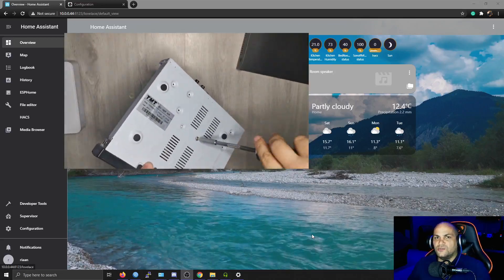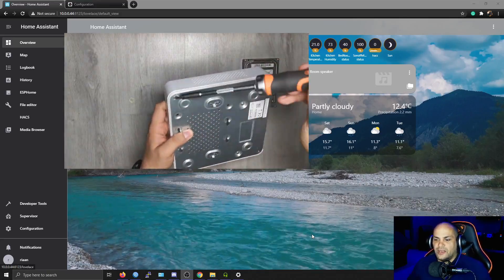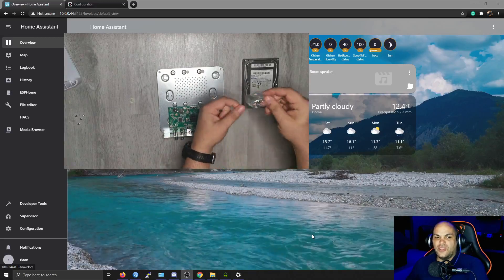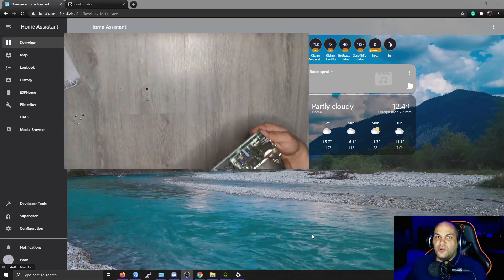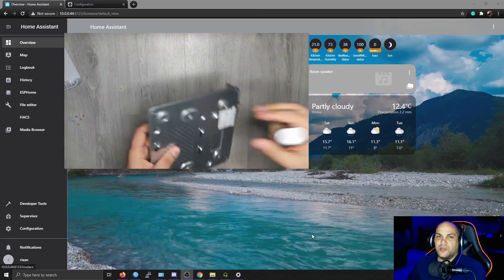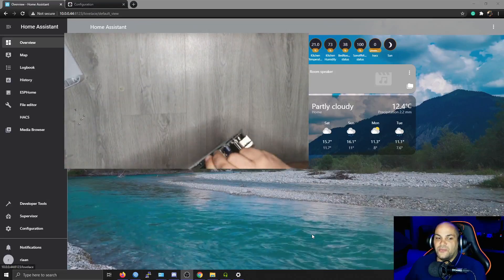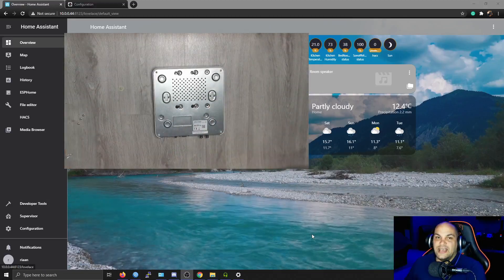All my cameras are already installed, so all I need to do is pull out the existing DVR and plug in a new one that supports the ONVIF protocol. If you're like me and still have analog cameras you're happy with, but you're trying to find a way to get that into Home Assistant, what I did was go online and search for the cheapest ONVIF DVR or NVR system I could find. Once we have ONVIF support, we can add that to Home Assistant.